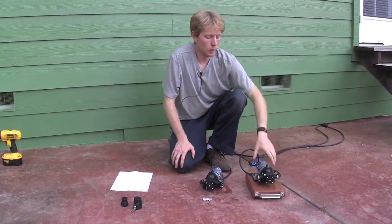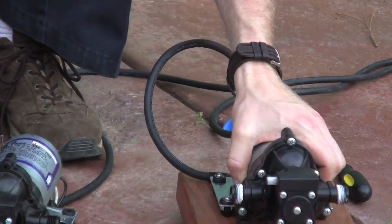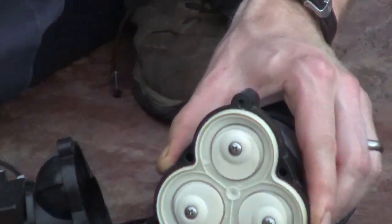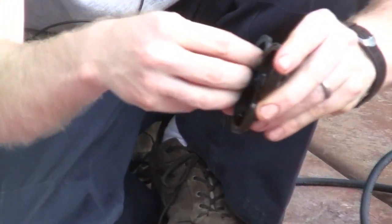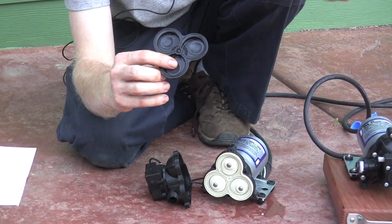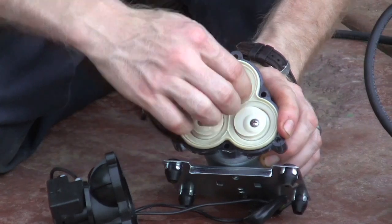To access the diaphragm, you just remove these six screws — this is basically the same on all different SureFlow models, with six screws going around the top of the pump. The top just pops right off very easily. Inside, you have the actual diaphragm, which pops right out — it's a very simple little gadget. The diaphragms are small circles on the inside where the plastic bends back and the liquid passes through. That's where it would get clogged; sometimes a little piece of debris in that seam will prevent the diaphragm from opening and closing completely. When cleaning, you can clean out the diaphragm if there's accumulation there, and also get inside the rubber housing with a Q-tip.